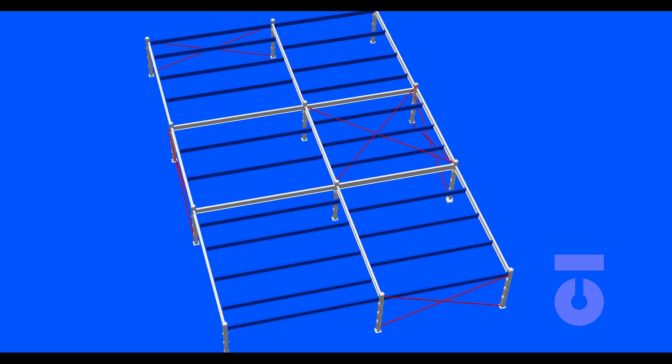Now let's plumb our west side of our structure. We are going to add X-bracing between the middle columns here to ensure that our west face is pulled plumb. It's technically all connected by beam, so we don't necessarily need to do every bay or section — just pulling the middle will pull our entire side square. We'll do the same thing for our east face. That covers plumb for just about all our perimeter columns, but we have two columns in the middle that also need to align to plumb. We are going to add X-bracing going from top of column to top of column, creating X-bracing in the roof — essentially this pulls our roof face into plumb.